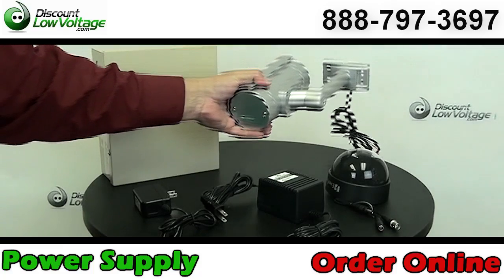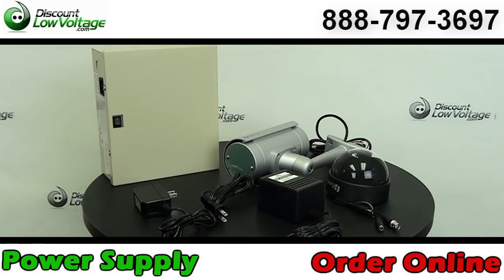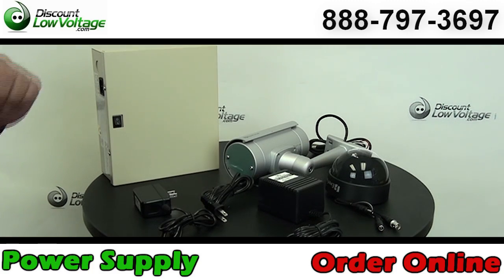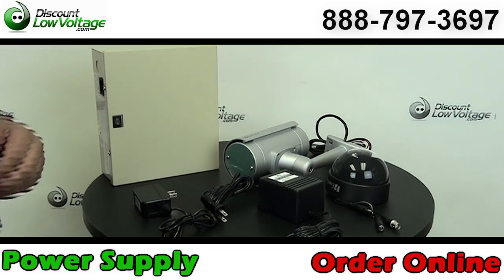Why would you consider paying more money for the 24 volt power supply? Well, sometimes there are camera runs that are really long. I'd say security camera RG59 with power, typically about 200 meters is a good ballpark range to where you're going to get signal to your camera with no issues. Anything further than that, you might want to roll with the 24 volt to give it that extra power so you don't have any issues with the IRs lighting up properly and getting a proper image on the screen.